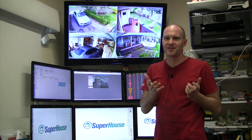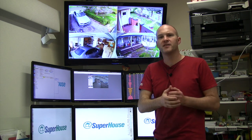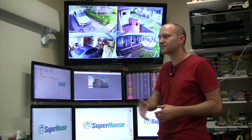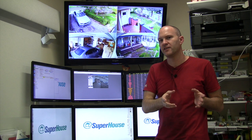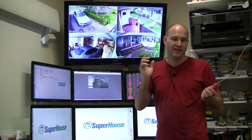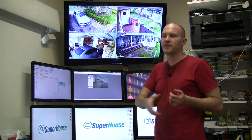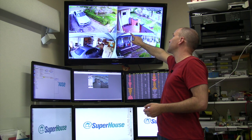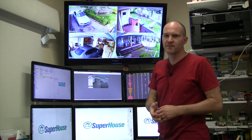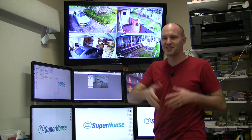This video is already way longer than I expected. I had a whole list of extra things I wanted to show — for example, how to use a Sonoff to control power to the monitor so that when the home automation system detects me walking in, it turns the monitor on, and turns it off again when I leave to save power. I also wanted to show how to distribute video from the DVR using something like a wireless sender to other TVs around the house. And there are extra software features — like the motion detection you can see right now with a little person icon appearing because the trees out the front are blowing around. You can even set up specific zones to exclude areas from motion detection. But I don't have time to cover any of that in this video.